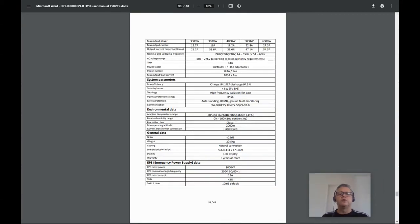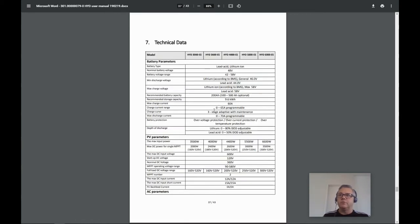What do the inverter specifications mean? You'll notice most of the specifications are the same for all the units. The inverter rating refers to the maximum power output for the connection to the grid from solar and battery. That doesn't mean each individual energy source can supply this though. The maximum battery discharge rate is 70 amps. For a 48 volt battery system, this is 3,360 watts.